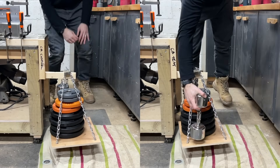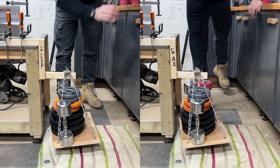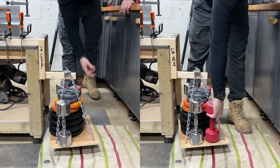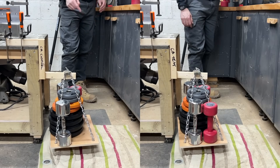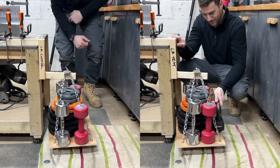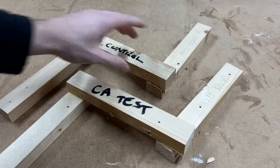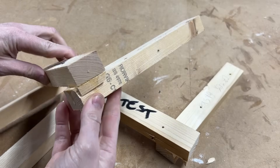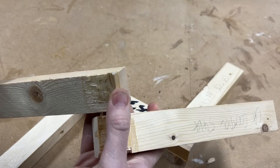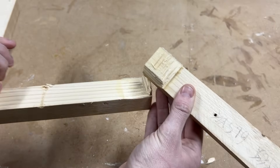Lastly, testing the CA glue. I'm constantly amazed by how good CA glue is — if it wasn't so expensive I'd be tempted to use it for absolutely everything. It's holding ridiculously well. The test piece is slightly ahead, so dropping 5 kilograms on the control brings both to 53.5 kilograms total, then 8 kilograms on the test piece — and boom, both break. The control piece did 53.5 kilograms or 118 pounds and the test piece hit 61.5 kilograms or 135.5 pounds. Both ripped chunks out of the wood.